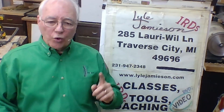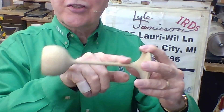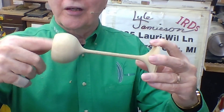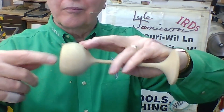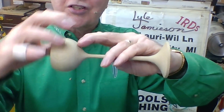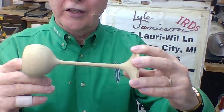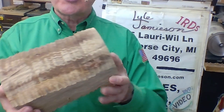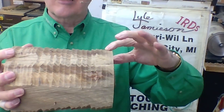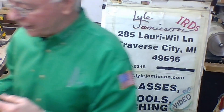The second thing is we don't want the wood itself to flex. A good illustration of that would be doing a goblet. I can't turn a goblet stem all the way down and then go and hollow it — it would flex and vibrate. So I have to keep a mass of wood behind it before I finish the stem. I've got to do this in stages, and I do my hollow forms in stages also so that I don't allow the wood to flex. I left this wood so big to have support for it, so that when I make my hollow form I've got a base of wood to support it and the wood's not going to flex and vibrate on me.